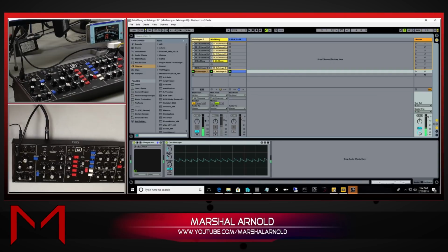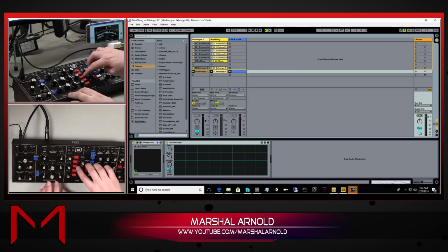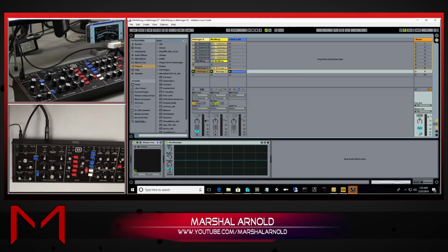All right. So now we have an A. But what if we go down an octave? Go down even another octave. You can see we've got some drift here. The other thing is, if we switch down one of these other oscillators, let's just play an A. So that one's out. And let's see how bad the other one is. It's out even more. So these are normally set here with the additional oscillator 2 and 3 tuning dials.